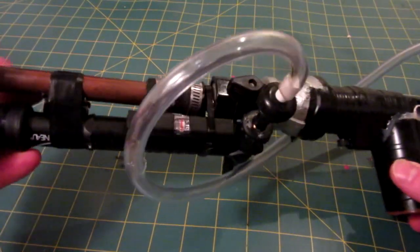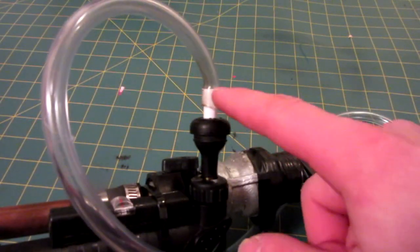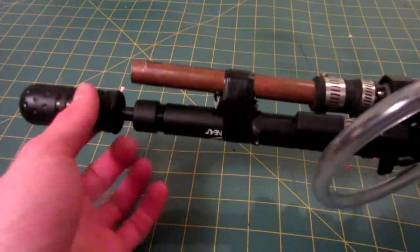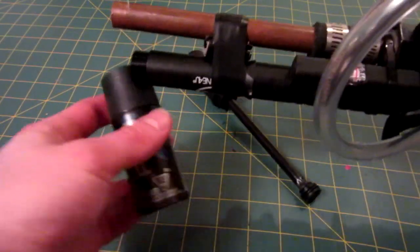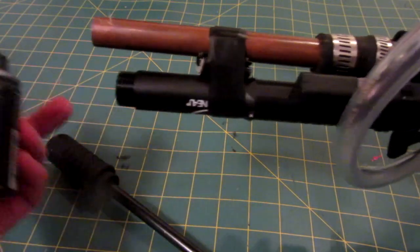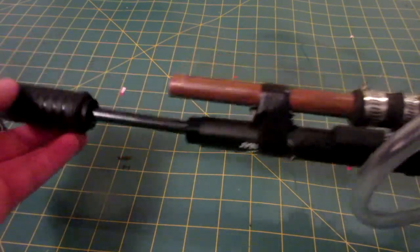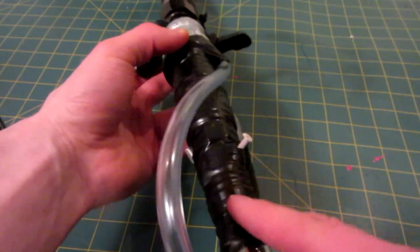In today's video I modified it a little bit with a pump. All I did is install a little portable bicycle pump on a valve with an adapter going to this hose, which goes in the end, which is now affixed. So instead of taking it off every time, what I can now do is take this pump, unscrew the fitting — which doesn't take very long — pull it out a little bit, get your fluid such as axe. I find axe spray works the best, it's very explosive. Also keeps girls away — note that if you're in high school, this does not smell good. Anyway, you spray it in there, once you have a little bit in there put the plunger back in, pump it, which pumps the fuel and air mixture — which is very key — through the tube and into the combustion chamber.